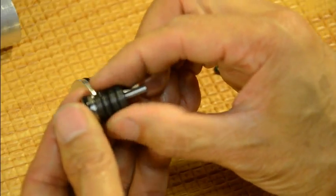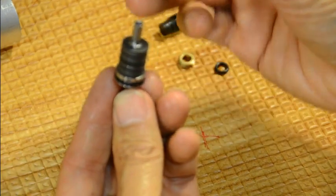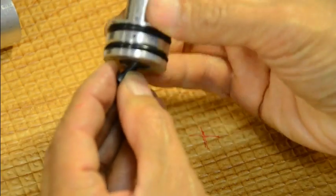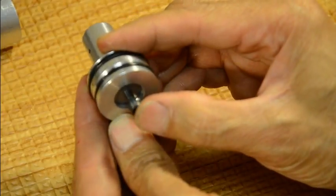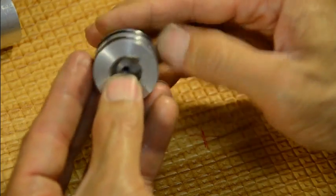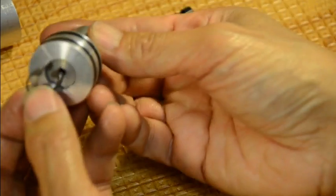I also re-lubed with silicone. When you reassemble it, put it in so you hear a little click — that means the o-ring has seated. Remove your screw, then put back the snap ring so the whole assembly doesn't come out. If it builds pressure without the snap ring, it will shoot that assembly out.